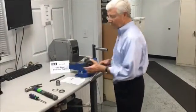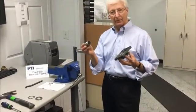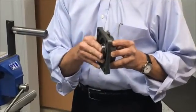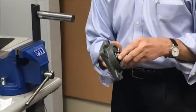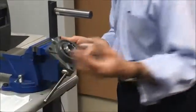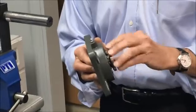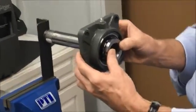The last of the four mounting methods is by means of a tapered adapter, which comes assembled when you receive the unit. The adapter is positioned in place along with a lock washer, which becomes the locking mechanism once installed. The locking nut then draws the adapter through the inner ring of the bearing as it tightens and clamps to the shaft. This is also a slip fit to the shaft.